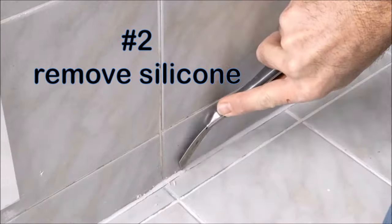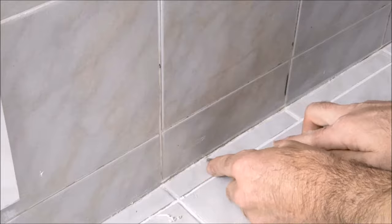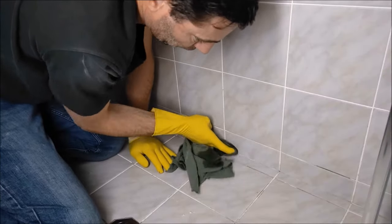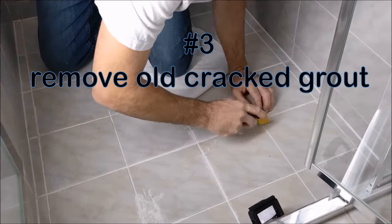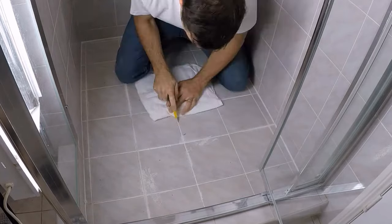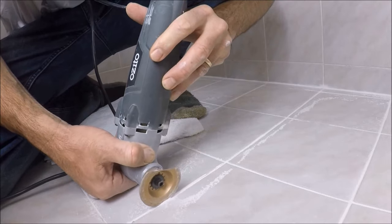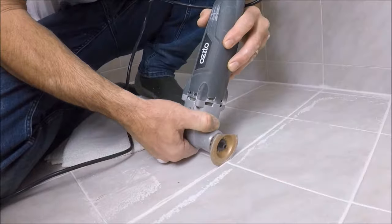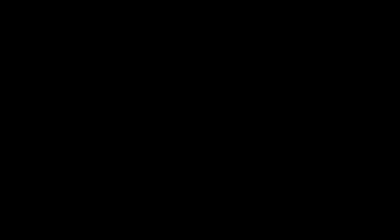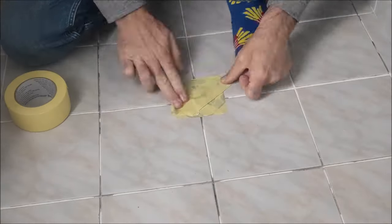The second job is to remove all the silicone from around the shower — heating it up with a hairdryer and cutting it out with a sharp knife or chisel, then cleaning off any remnants with methylated spirits. Next, remove all the old grout using a grout saw or a multi-tool. I was glad to have a multi-tool because this epoxy grout was a really hard product to remove. Use a dust mask and ear muffs. All you need to do is remove a 2–3mm layer so a new layer of grout can be applied. I covered around the new floor waste with masking tape because I want to seal that area with silicone, not grout.